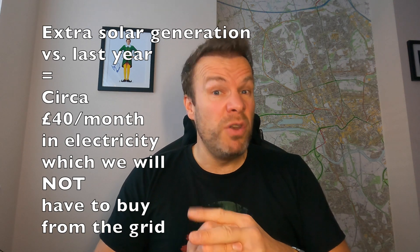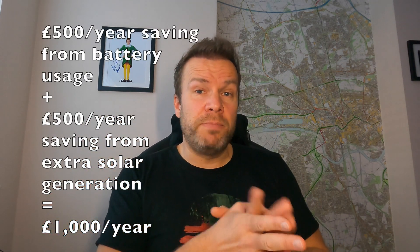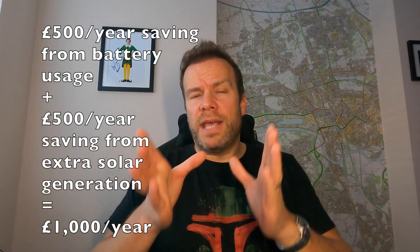Obviously not ideal. But then of course the upgrade in the solar — the value of that is quite important. If we look at that throughout the year, I estimate we'll probably generate the best part of another £40 per month from solar value. So suddenly that's £1,000 a year in savings. £500 saved because you're using the battery, and £500 from the value of the solar — add it together, £1,000, and the break-even becomes 16 years. I cannot tell you how much electricity is going to cost in the future — if prices continue going up, that break-even point is going to come down. I also can't tell you about degradation on the battery; Tesla assure me it will degrade very slowly, but there are variables I can take into account and quite a few I can't.